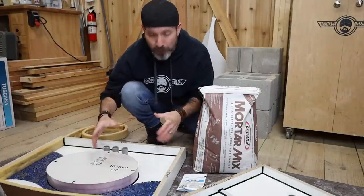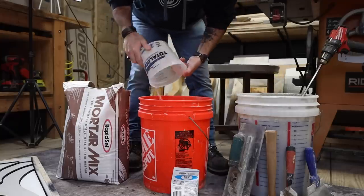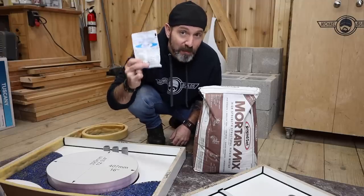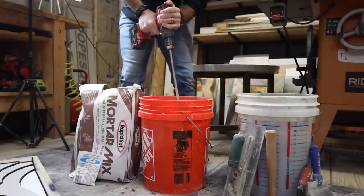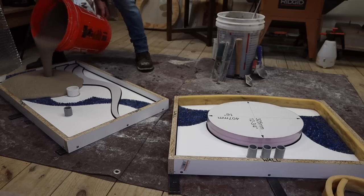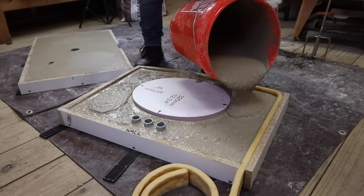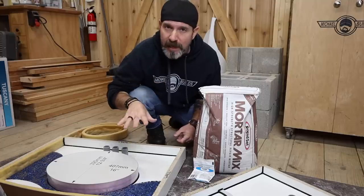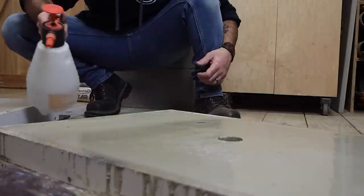We're going to spray the molds with WD-40 as a mold release and wipe off the excess. Then pour five quarts of water into the bucket first, pour in the RapidSet Mortar Mix, and mix to a peanut butter consistency. Then add the RapidSet Flow Control — a plasticizer that gives you pourable consistency and adds strength — until you get a pancake batter consistency. Pour the mold about halfway up, add your metal reinforcement, then fill the rest and tap or vibrate those bubbles out. Since you're using RapidSet Mortar Mix you can demold in one hour instead of waiting a week. In about 30 minutes you'll see it get very hot — that's when you want to water cure it for one hour or until the heat dies down to avoid surface cracks.